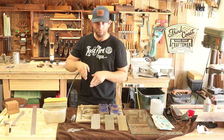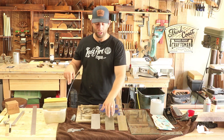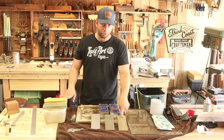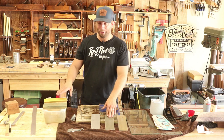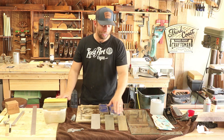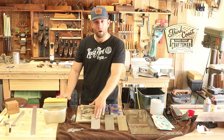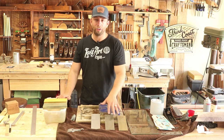If you tilt your plane blade while you're sharpening on softer wet stones, it'll gouge it — that's what the diamond plates are nice for. Since I bought this coarse, I went and got an extra coarse because this coarse is not that coarse; it's more like a medium stone. The extra coarse does pretty good at removing heavy material like if my blade has a nick. Then I also bought an extra fine because I wanted to kind of convert to all diamond.